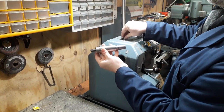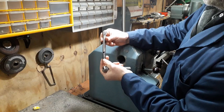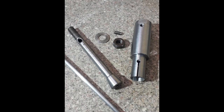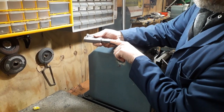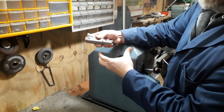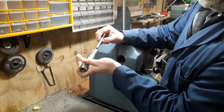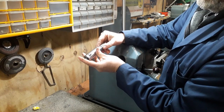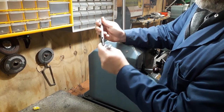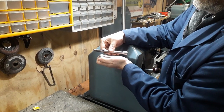We have the outer part, which is reduced on the end to fit inside the bore. We have the drawbar, and then a little grub screw. So as mentioned, this is tapered inside and split so it can expand. The drawbar has a matching taper on the end to allow it to expand in there. The grub screw passes straight through the drawbar and locates the rod inside, and we've put a slot inside there to allow it to tighten up and down.